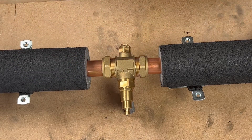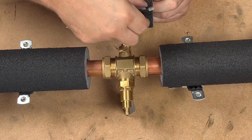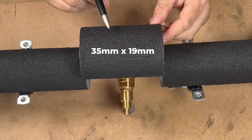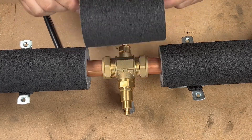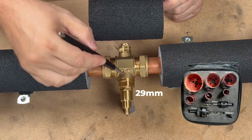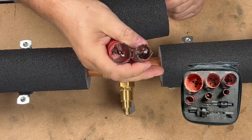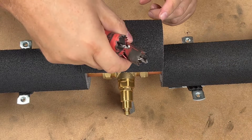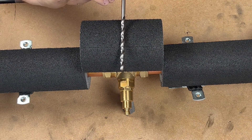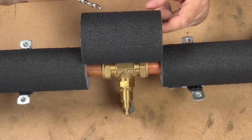The first thing we need to do is cut a piece of insulation. The best size for ours is 35 by 19 because it'll go all the way around without needing an extra piece in the bottom. We've got 28 by 19 on this side, 28 by 19 on this side, and 35 by 19 here. We then need to cut a hole on the bottom around 29–30 millimetres and a hole on the top around 19–20 millimetres. We've got two Rothenberger core cutters and it's best to use a long drill to go all the way through so you can centralise both holes.